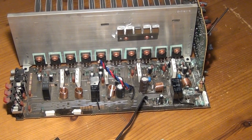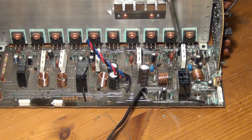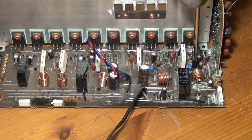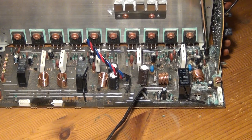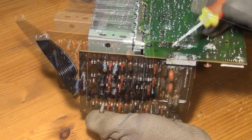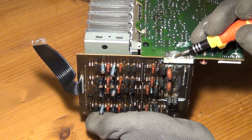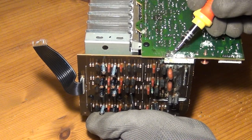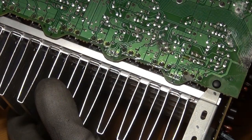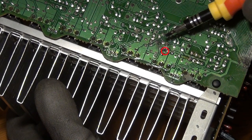Let's take a closer look at the damage. This little electrolytic capacitor at some point overheated — the vent had broken, spilling electrolyte on the PCB, which caused corrosion on a lot of parts. There are also at least two or three resistors that have burned through. On the bottom side of the PCB we can also see traces that have completely burned away. The electrolyte also drained over the riser board carrying some kind of pre-amplifier stage, and you can see damages there too. Some solder on one of the power transistor connections has also melted, indicating an excessive overcurrent situation.